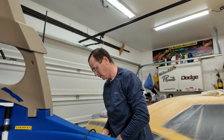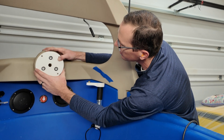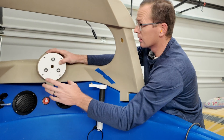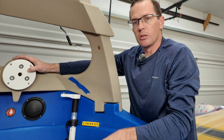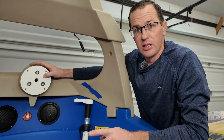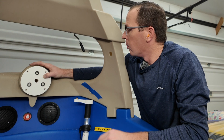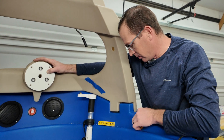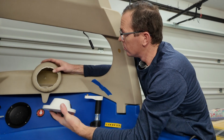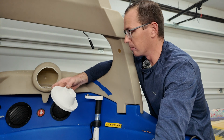Okay, we've got something to work with now. The plan from here is to use some rivet nuts, and it's really important not to over-tighten them — I've done that on one of these holes and it pulls right through, so we've got to be a little sneaky with that.